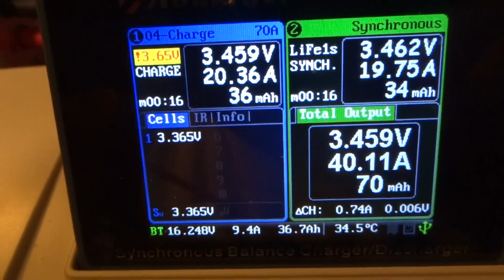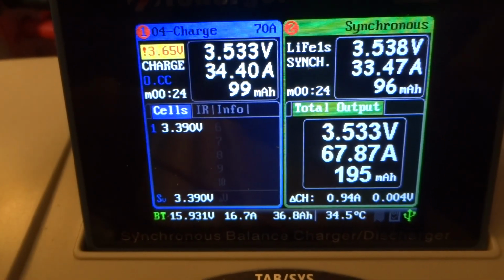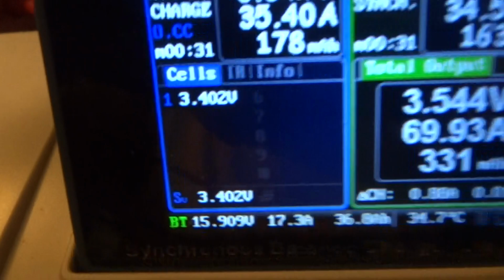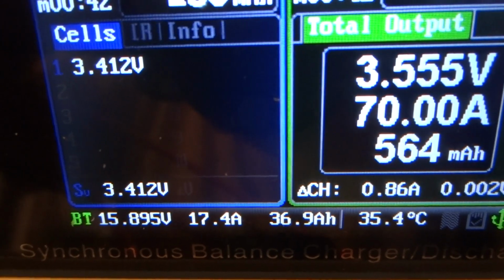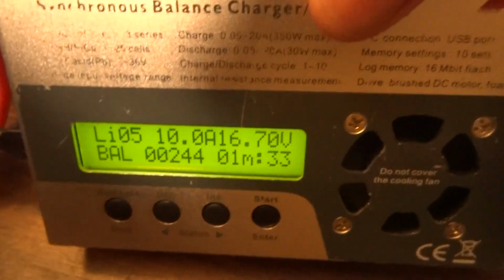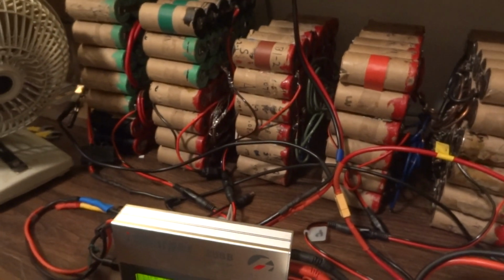I'm going to make this part 1, and put another video, part 2, where I do the discharge. And here we see 65 amps, 67. Now it's almost there. 70, 69.8. If you look down here on the bottom, the battery behind there is giving me almost 16 volts, and it's pulling 17.4 amps out of the battery behind there. As you recall, this guy is pushing 10 amps into the battery, so this battery behind here is still getting somewhat depleted. But in the next video, I'm going to show you the discharge.